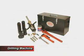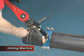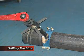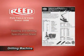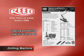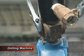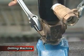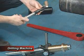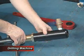Operating the drilling machine begins by selecting the proper tools necessary to perform correct drilling operations. Many of these items are required based on the type of drilling intended. Consult the Reed tapping and drilling specification sheet to determine what accessories will work best for the job. These items include the service saddle, corporation stop, drill size and drill adapter to match the stop bore, and the corporation adapter with a flush valve.